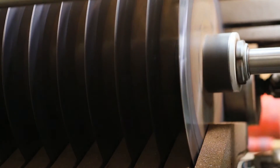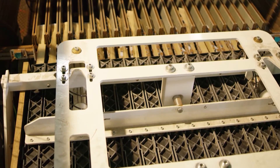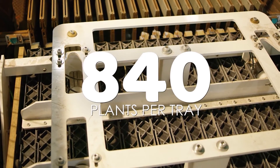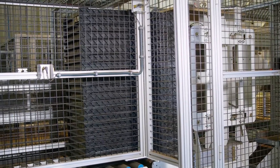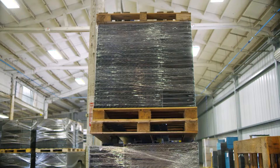The finished Plant Tape material is cut into 21 individual strips. The individual strips are stacked in an interlocking zigzag fashion to maximize plant density in the tray. Each tray contains 840 plants. Once finished, the completed trays are then automatically stacked and delivered to the end of the sowing line.